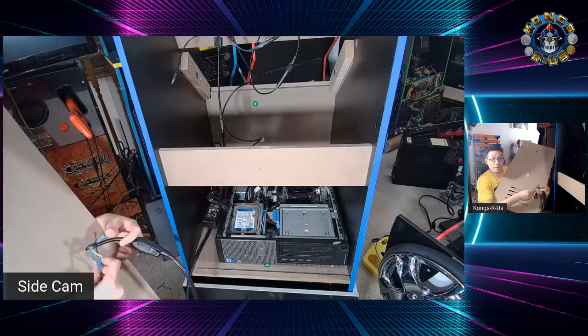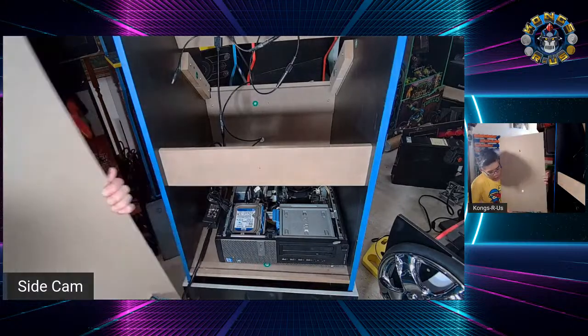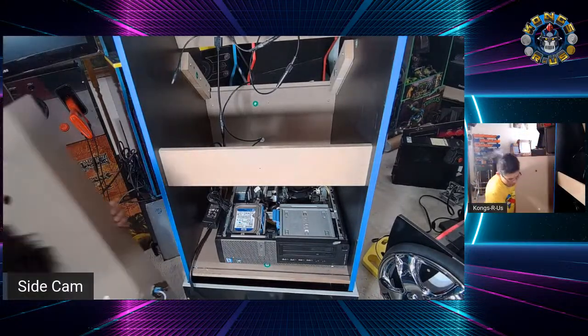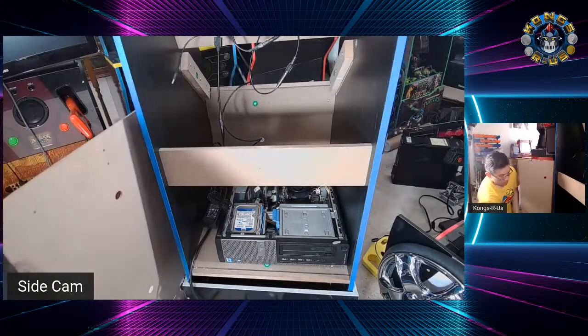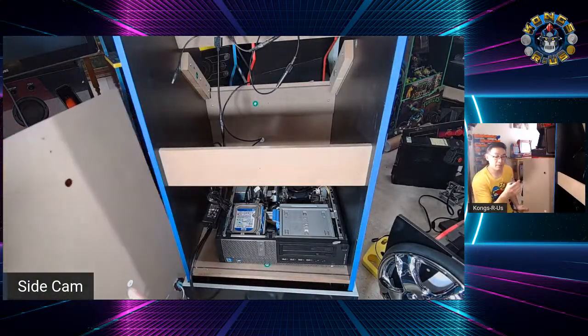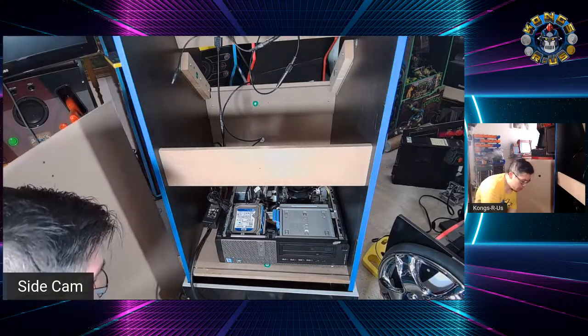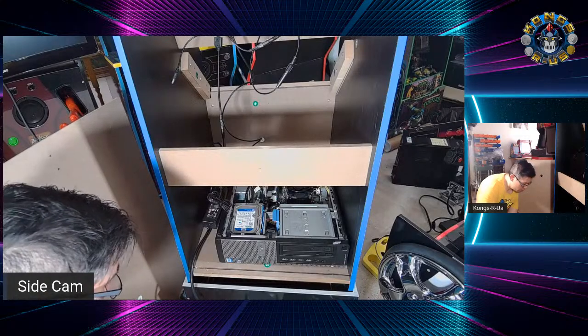This little wire keeps popping off, so I highly recommend making sure that your inlet module protector or surge protector or inlet module switch, all the wires are crimped down so they don't come loose like that. If it does come loose, I recommend grabbing your pliers and squeezing down on the terminal a little bit more so that there's more friction when you put it over the terminal.